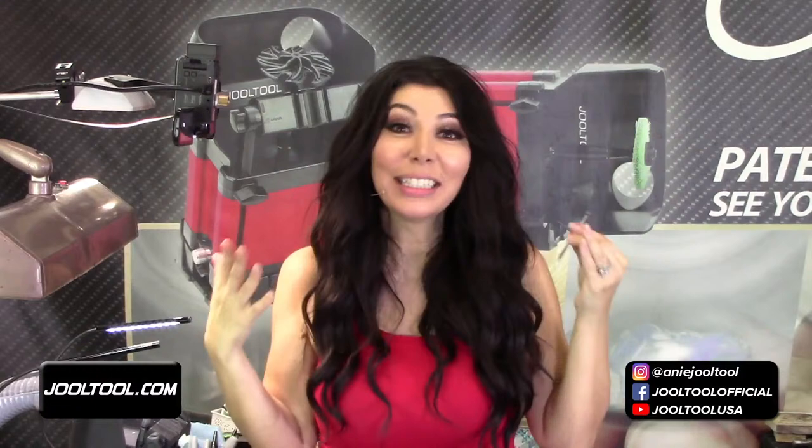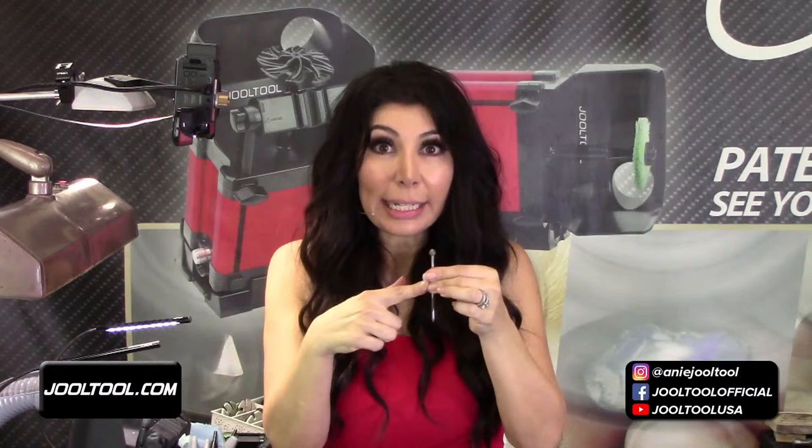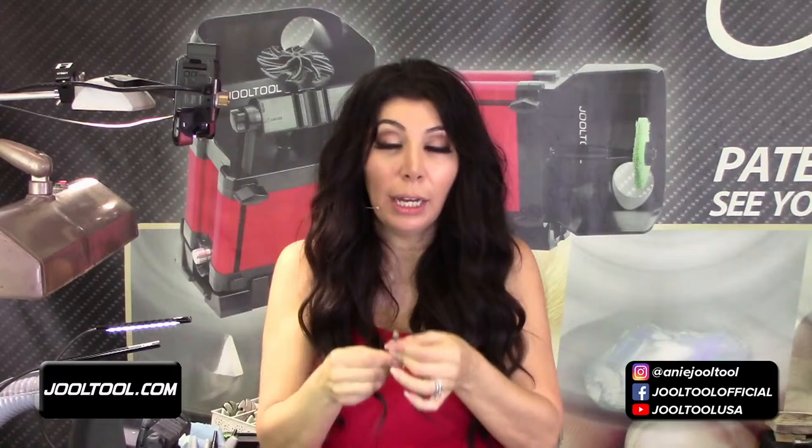So you guys, you can use your tool rest again. You just got to remember what angles you did. So this one we did 118, 90, and 60 degrees. So if I just follow those, I could do those again. But the last one, I couldn't see, so that might be tricky. That one for sure I would have to do without the tool rest. But yeah, you can definitely use it with the tool rest. I'll show you with, and then we'll do without.